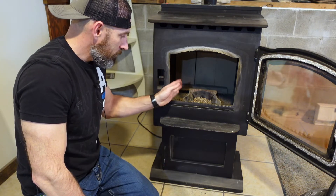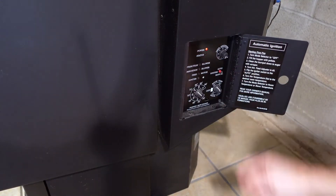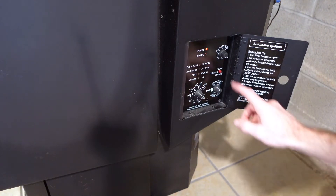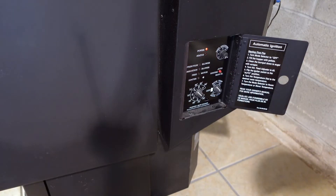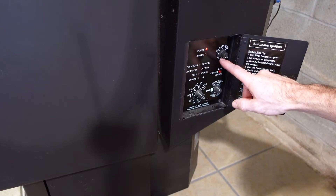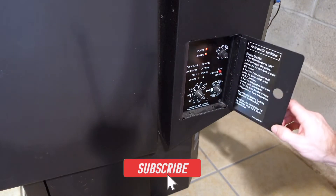So I sucked out some of the pellets. Now you're gonna have to put your stove in manual — you can't leave it in auto. Cause if we leave it in auto and start that up, eventually it's probably going to go out and it won't restart. So you have to put it in manual. And I kind of like to normally keep my feed adjuster down on a lower level if I have it in manual, it seems like it helps it not burn my pellets up as fast.